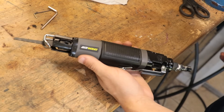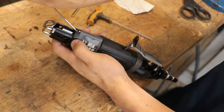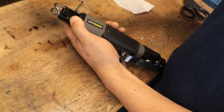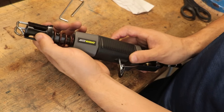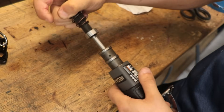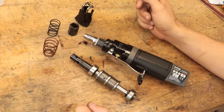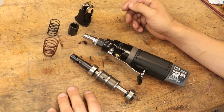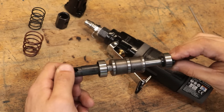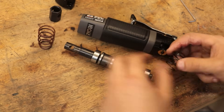The first thing I'll do is get it pulled apart so we can see exactly what we're dealing with. Like most air tools they're pretty easy to pull apart — the front housing comes off with three screws and everything just falls out the front, just be careful because the front part is holding back two large springs. And that is the saw pulled apart. Like most air tools there's almost nothing to them. It's mostly just a double acting piston where you can attach a blade to the end, shooting backwards and forwards creating momentum, with springs at each end.